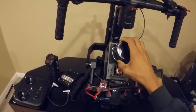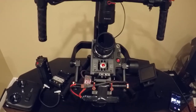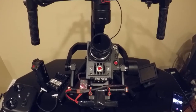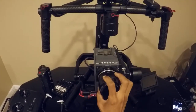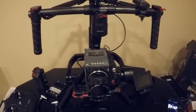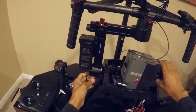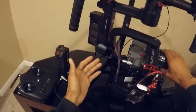I don't really need the tilt extension arms. It probably would be easier for some people to use the tilt extension arms that a couple of companies are making, but I just quickly wanted to put this on and see if it would balance since I knew I had to use external power to power the Red and keep it light. The tilt's pretty balanced. One of the biggest issues with the Ronin M — and even the regular Ronin — is this cable in the back. It creates tension and pulls you down when you try to check the roll balance.